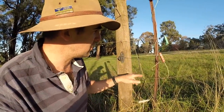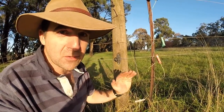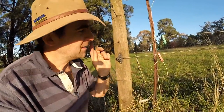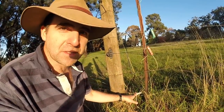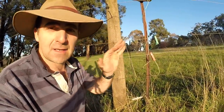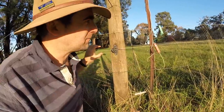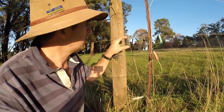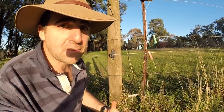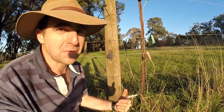However, by connecting your earth to wires in your fence, you've effectively got an earth wire running around the entire fence. When the ground dries out, your animal's still going to get a shock from touching two of the wires. Smart operators will also, about every 500 metres or so, put in another earth picket and connect it to those — so no matter where the animal is in the paddock, they're near an earth and near a charge wire. We're using 2.65 wire so we get plenty of electrical flow through the charge wire and through the earth wire. If you're on sandy soil, you'd probably want to bring your earths even closer still. You cannot put too many earths into an electric fence.